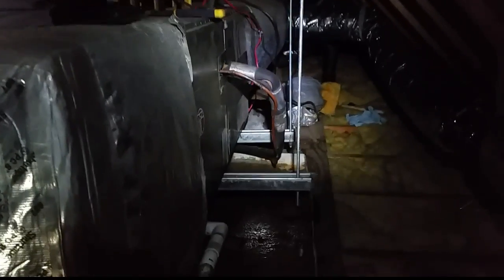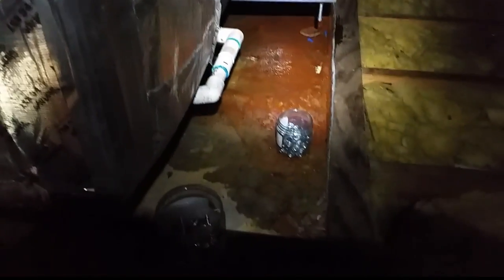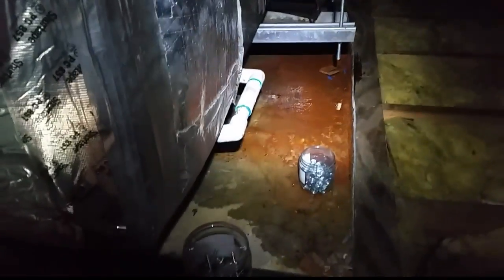It's tough. It looks like that drain pan needs to be replaced. I've tensioned the strut up on the other side. The unit is level front to back in the center, so now we're going to get it level side to side. The drain pan has got to go. The good thing is I can take the center blocks out because the unit is hung and just slide another pan underneath it — really easy. I don't have my pan with me, so that part is not as good.